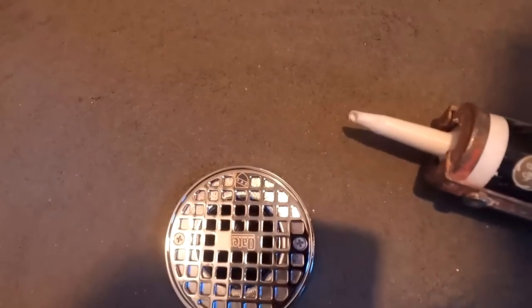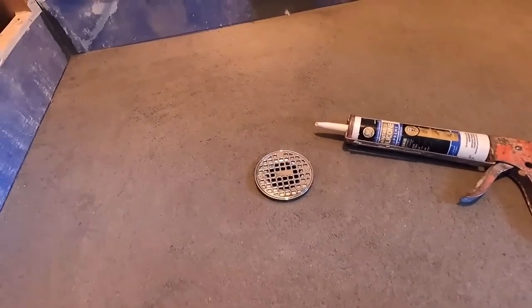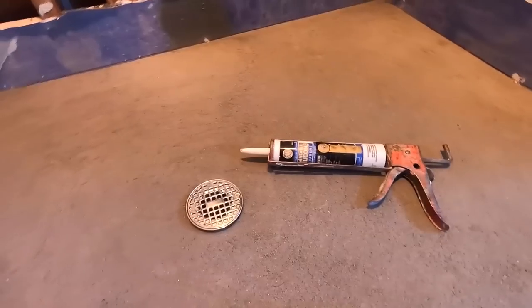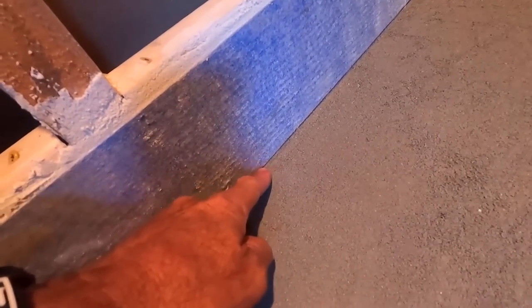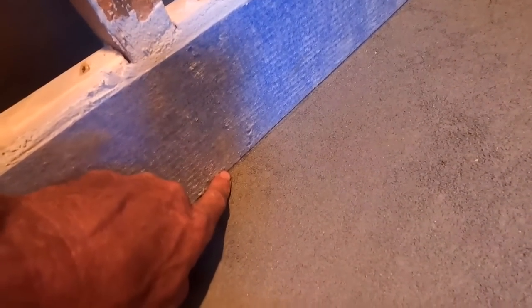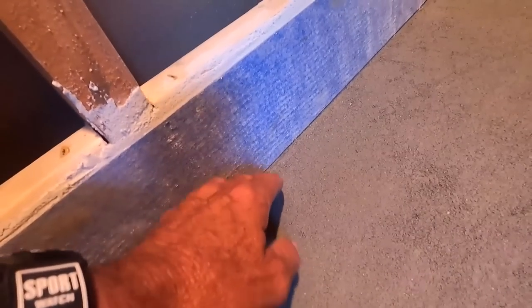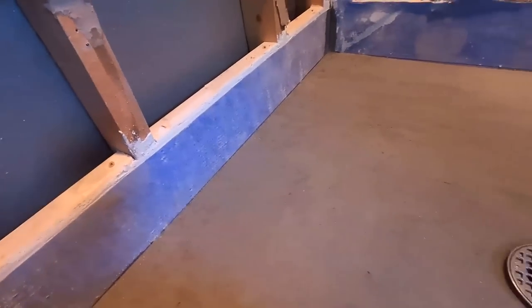As many of you know, I make my own waterproof pan, and the water in, water out system and the pre-slope and all that stuff doesn't apply anymore. When I get questions, where the pan material meets your shower pan liner, should I run some caulking along that? I'm like, why? Because you're pushing RedGuard in between that. So the RedGuard is going to stick to both the rubber and the mortar. You could do the caulking, I don't see the point.